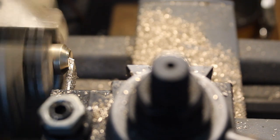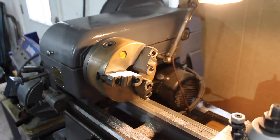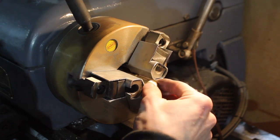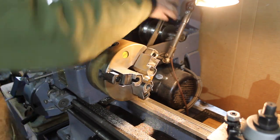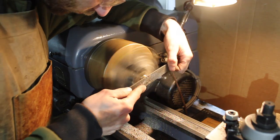Whoops — that's what I didn't want to do. I have these couple of aluminum soft jaws that I made up a while ago, and I can stick those on the jaws so I don't mar up the bronze. That way I can mount the cannon in backwards and clean up the back side of that radius with a file. Changing the speed to speed the machine up after parting, just truing that up with a file — that works out really well — and then a little file to refine the last couple details.